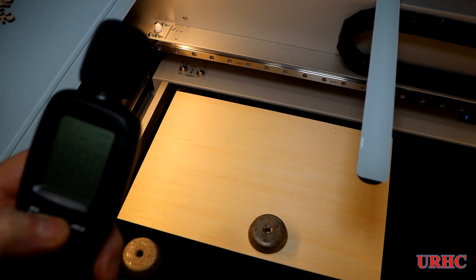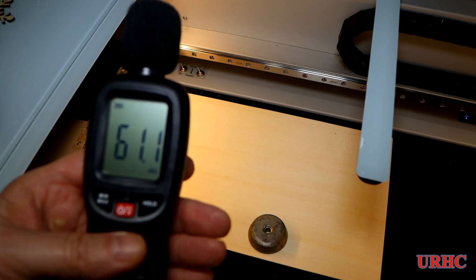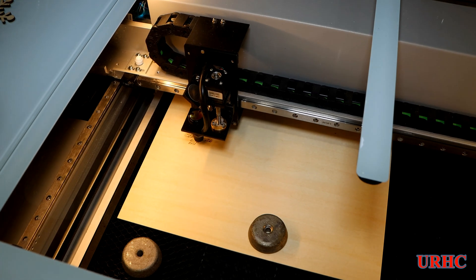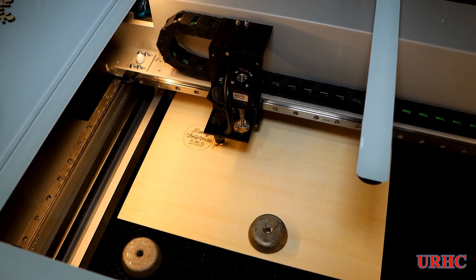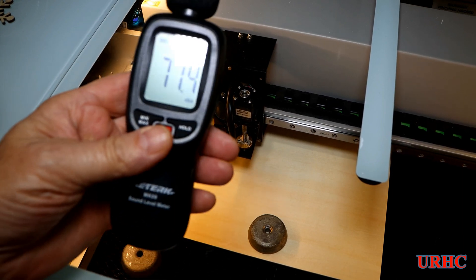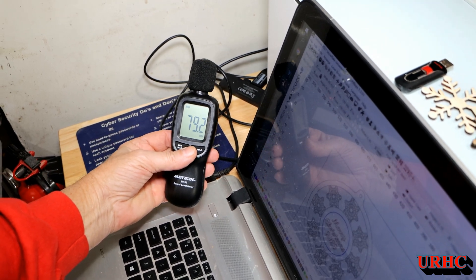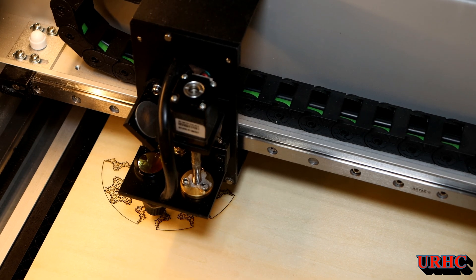One of my subscribers sent me artwork for an ornament he wanted me to try to cut. First I want to show you — this thing is quite noisy. When you first turn it on doing nothing, it's in the 60 decibel range, then goes up to about 72. Once it starts running, it goes way up. There's no way to turn off the fan, pump, or anything — it just sits there burning power while you're working in LightBurn. Hopefully we'll find a way to shut it down when idle. Over where I have my computer it's almost 80 decibels — there's an exhaust intake under the radiator. Probably not going to work well in a quiet office.